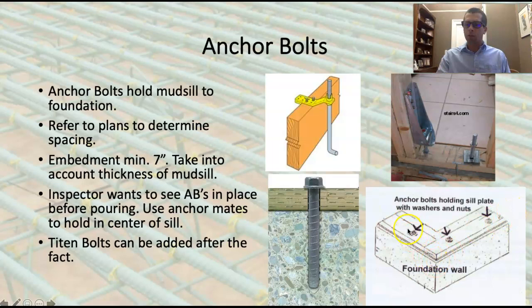If we're pouring a slab foundation, we won't have floor joists — the slab is the floor — but our walls attach directly to that slab. So we need to lay out all of our studs so that they miss the anchor bolts. We don't want to place anchor bolts willy-nilly and then have to notch studs or move them out of the way later — that turns into a nightmare. We want studs every 16 inches on center so we can take a piece of plywood and put it on the wall without worrying about anything. Laying out all anchor bolts beforehand and making sure we have the appropriate number is a critical step before we pour.